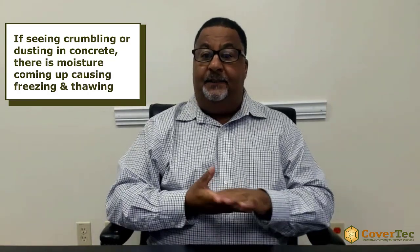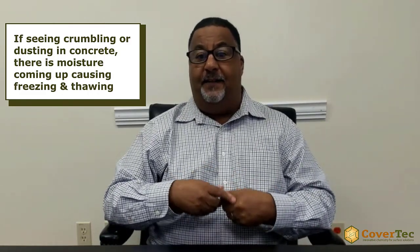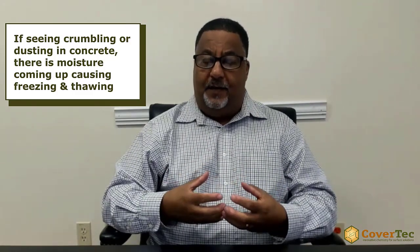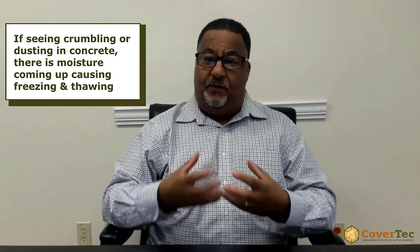If you've got concrete and you're seeing signs of crumbling or dusting, again, that's probably because moisture has got into the concrete, and then you have a freeze-thaw action. As the water freezes, it expands and it crumbles and cracks that surface. So again, if you're seeing signs of that on concrete or on your pavers, that's another indication that you should be using something like the Pen 50.